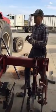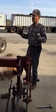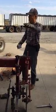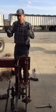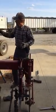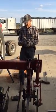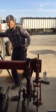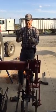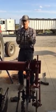And the other reason is, let's say you've got wet spots in your field and you don't necessarily want to just stop and turn around. You'd like to just go ahead and cultivate through them because otherwise you'll have a weed patch. So you sacrifice it, you work it a little wet, because you want to get through it. If you ease up very carefully on your 3-point hitch, you put more weight on the tractor tires, getting more traction, you can actually walk through those wet spots and still control the direction of your cultivator.